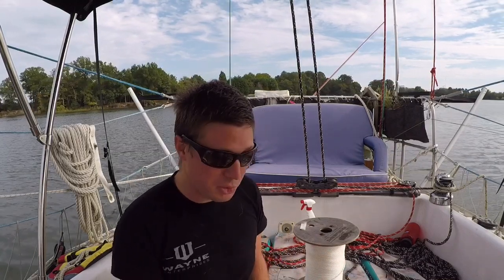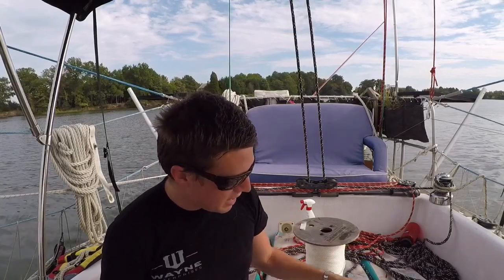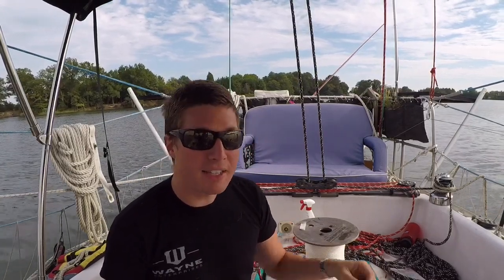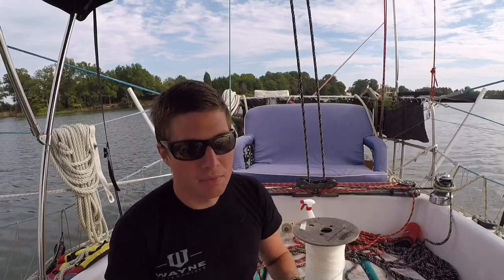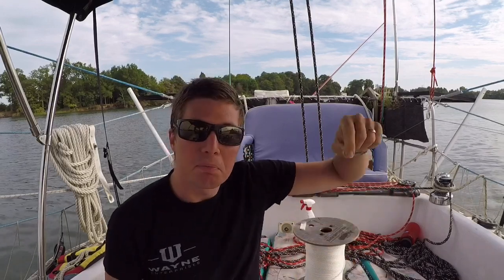So I'm simply going to tie the rope through this guy. We'll tie it so that it sits flat. And then we'll just put knots every fathom, which is every 6 feet. And then we can just go along in the dinghy, which doesn't draw anything, and drop the sounder in and see how deep it is in any direction we need to go.